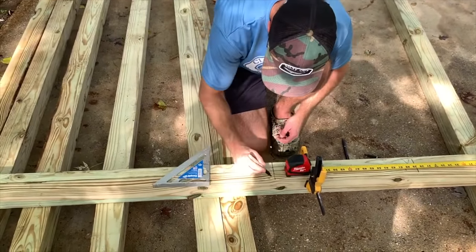And again, you're gonna mix part A with part B in a mixing bucket. And this time I just used a hand mixer, just a painting mixer stick, to mix that up. And something I want to note is that this primer is typically the first step if you're applying epoxy on a concrete subfloor like a garage. But because we're doing ours on a wood subfloor, this step was preceded by the flex application,